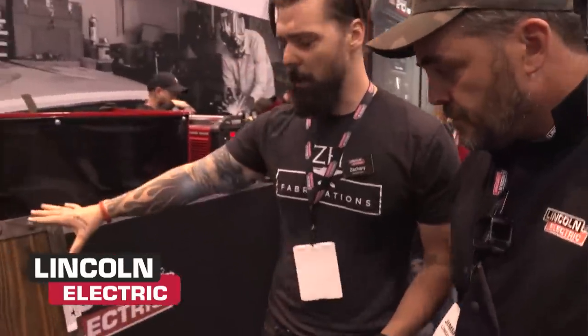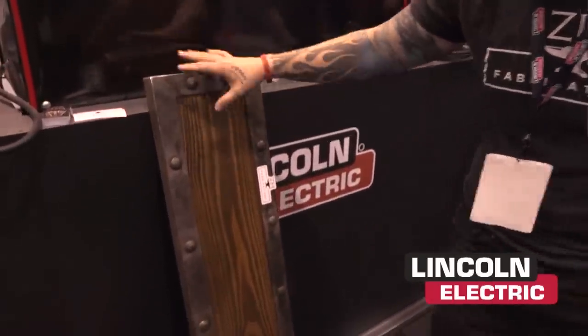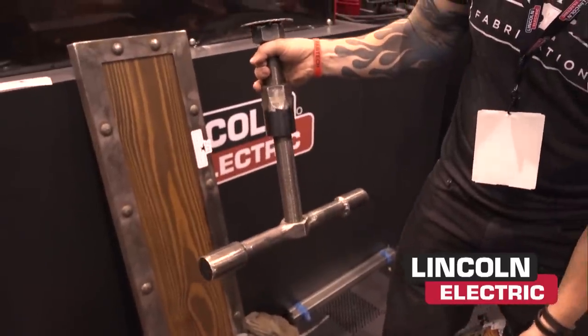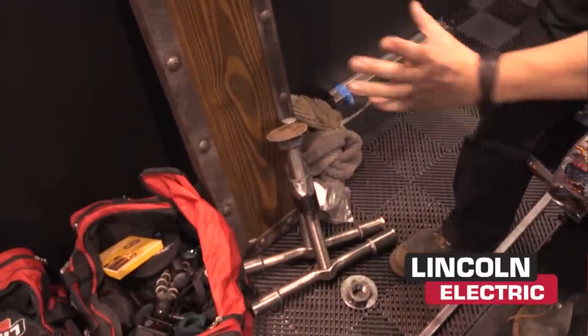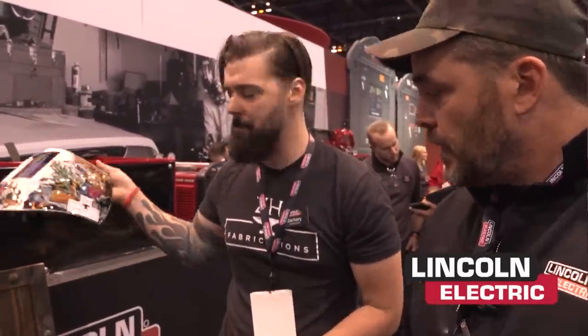So I built this part in my shop here. I built a bench for the table. This is what I have so far. This is the legs with some pipe and some inch and a half all thread. It's actually going to be a C-clamp. The table is going to be held in place by two giant C-clamps. And the C-clamp profile is going to be cut at a quarter inch on the plasma table there, so yeah. Right on. And then you're going to be fabbing that all up a little bit later today. Yep. Right on. We'll check back in.